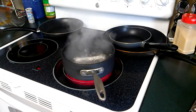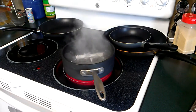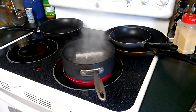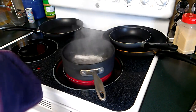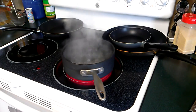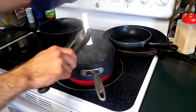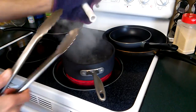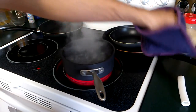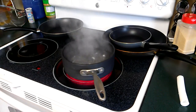It's not as hot as it is when you use the heat gun — you can get it a lot softer with that. But just in about 45 seconds to now about a minute and a half, we've seen it go from normal room temperature to flexible enough to bend in half. I hope that sort of puts paid to the idea that boiling water is inadequate to shape PVC.